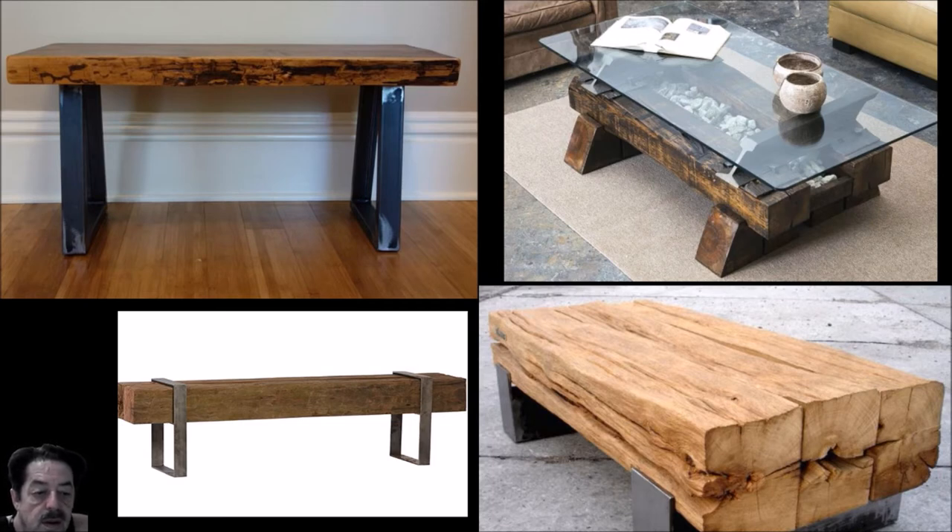On the bottom left, this is just flat plate steel from the steel supply yard — you make rectangles, and there's a bottom piece that supports it with the top piece coming over and bracketing it, then lag bolts hold it in place. It's easy but not very fancy. On the bottom right, he used rectangular steel, welded flat plate steel uprights on it, and just set the wood in. You have to measure your exact width before dropping them in, but it's a simple and rustic approach.